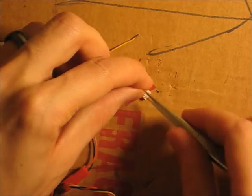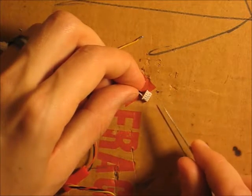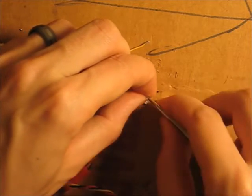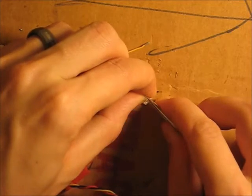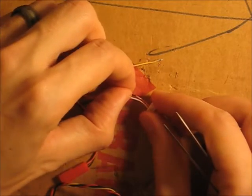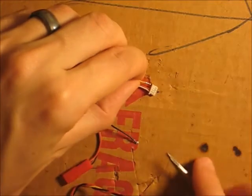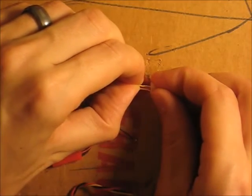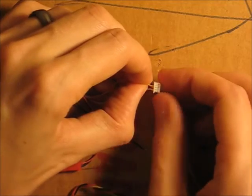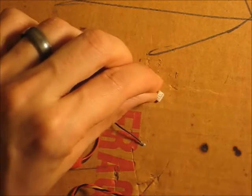Let's go ahead and do the same for the black wire. You don't need to use tweezers for this — just anything small like a little pin that you can pry this tiny little white thing up with. That was easy — I just pried it up and it pops right out. Let's put this yellow one in where the black one was. Just push it in and it actually clicked into place — that white little top came down.